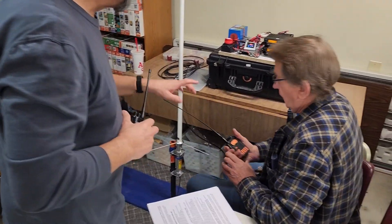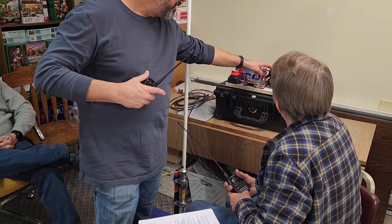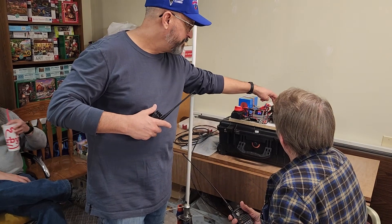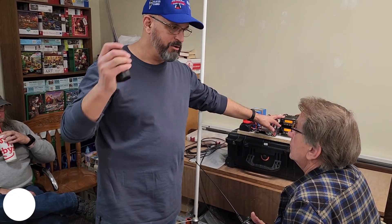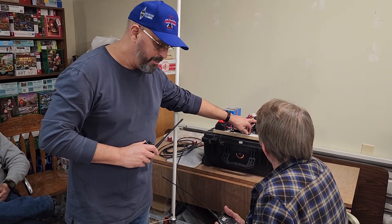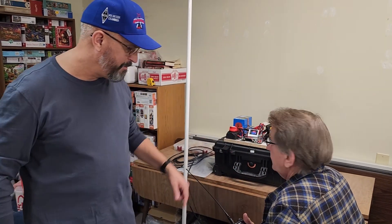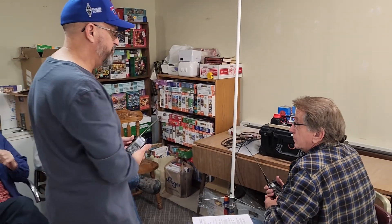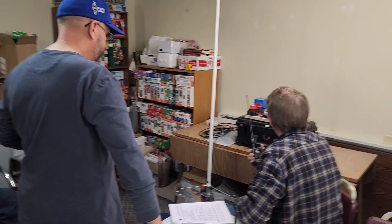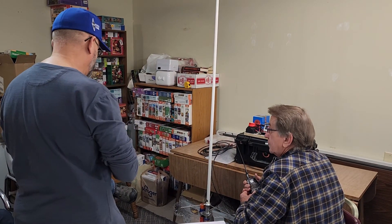This is Mike's first opportunity to work with these CBRs. The setup has each frequency with a PL tone on both radios set for tone squelch — both decode and encode — at 250.3 Hz on both. So if you're helping on race day and your radio is on in your vehicle, we'll get a list out with all the simplex frequencies. For today, 146.55 MHz has a 250.3 Hz tone. Mike tests by playing the backbone while another operator transmits, verifying that the cross-band function works correctly by going through the P1 button.